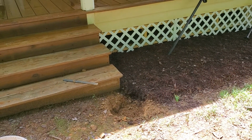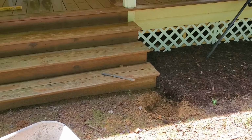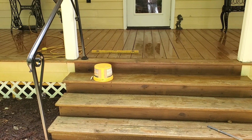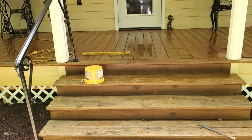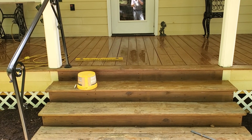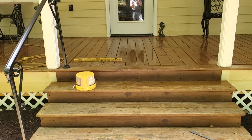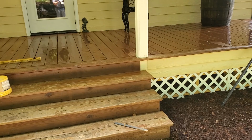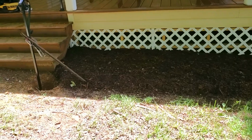So hold on, I'm gonna finish up this one hole, get this anchored into the floor. I'm using 1/2-inch lag screws. I'll drill a 1/4-inch hole into the wood, sink those galvanized lag screws down into that wood, and then pour the fronts, and this side will be done other than touch up. So hold on just a little bit.